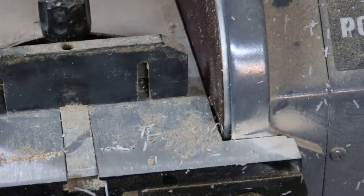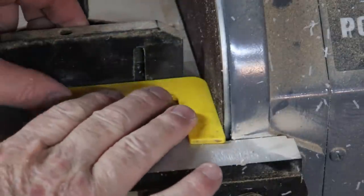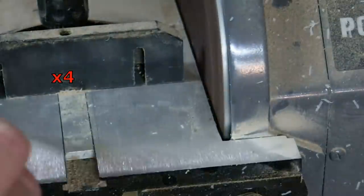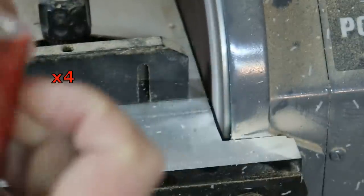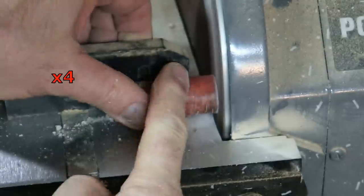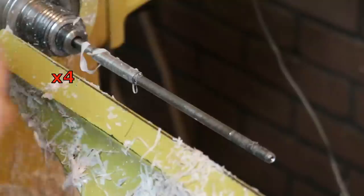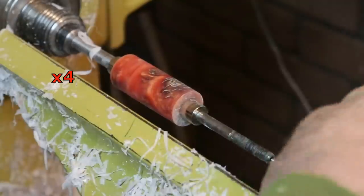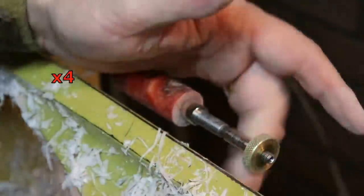Now that I have all the little cylinders made from the blanks, I'm going to make sure this bench sander is true to 90 degrees horizontally and vertically, and then I'm going to trim these down to the length of the tube that I had inserted. I'm using a bench sander for this because I don't have a barrel trimmer, which is a specific tool for this purpose. If you don't have specialty tools, you can still get the job done for the most part.